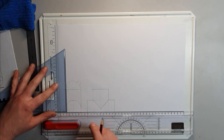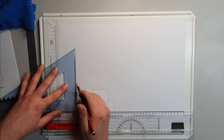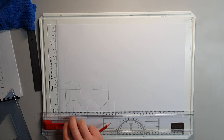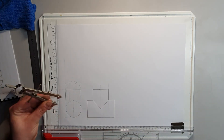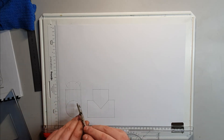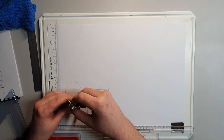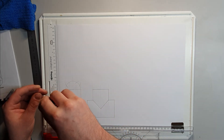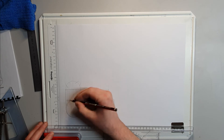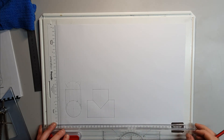What you would notice is because this is the same diameter to the same diameter, if I did the same thing here these lines should match up. This isn't always the case — if you're doing one that's a different diameter, these don't match up, there's an extra step. So all those points should line up: there, there, there, there, there, and there. We can actually just transfer them across — I'm going to transfer them across the whole way because I'm going to develop a pattern out from here.